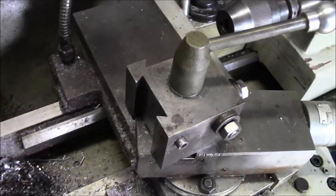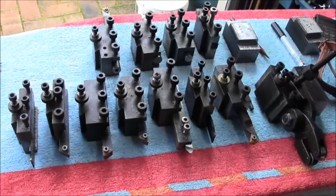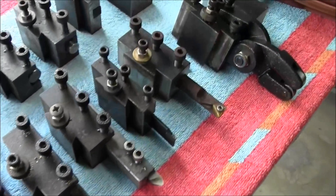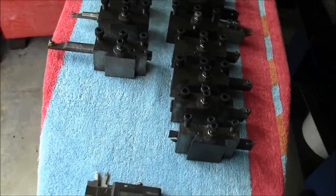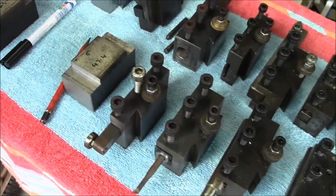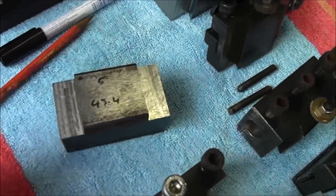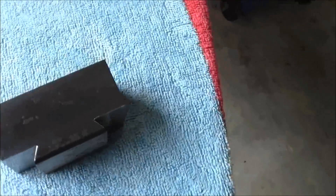I'll just show you my selection. These are the ones I made with the manual mill, and I also found out that a single-flute cutter with the carbide insert was the way to go - the homemade one which is working away in the background now. These are some of the homemade tools I've made. I've blanked out this one here. This one's an earlier one - it's a little bit off so I've got to compensate for that. And this is the first one off with the CNC.